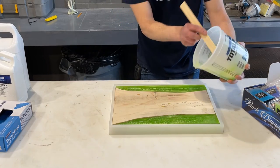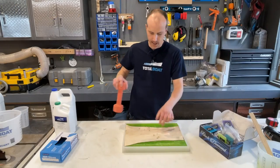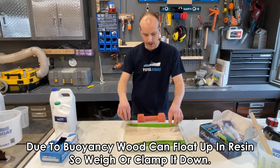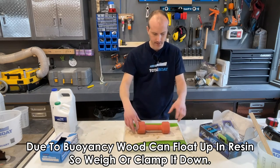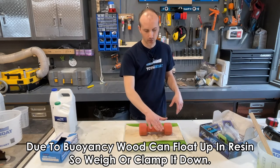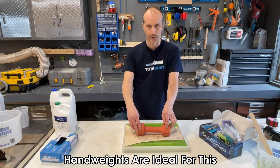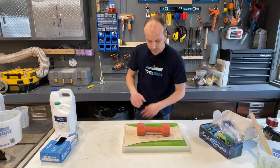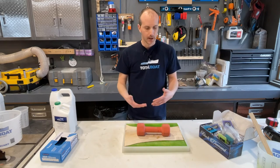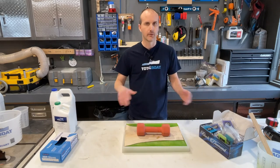Our calculation served us well — just a tiny bit of resin left, minimal waste. I've got one of our hand weights here: wood is buoyant, and that same buoyancy applies in resin — the resin will push under the wood and lift it up if you don't weight or clamp it down. I use an 8-pound or 15-pound hand weight for bigger slabs. You can also use clamps. The key is having enough force pushing the wood down so it doesn't rise up with the resin under it. If you don't, the wood rises, resin gets under it, and you waste resin — though you can plane or sand it down later.